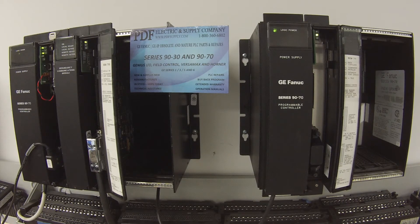If you're following this test: when you install the BEM713 in your Proficy software, a configuration screen will pop up and the only thing it will ask is whether an RCM is present — yes or no. You must select yes in order for the test to work and for it to go into run mode. The system will see that there's an RCM there, so it can't be fooled. If the configuration screen isn't visible next to your info viewer, simply right-click on slot number three where the BEM713 is, select Configure at the top, and select yes that the RCM is present.